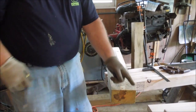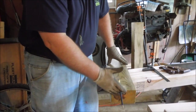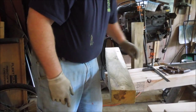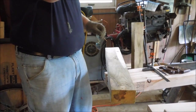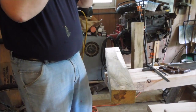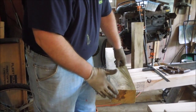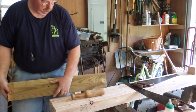If I were to try and cut it from one corner to the other, straight through, it's going to give it a tendency to wander. Even this wide saw plate, because of the set, the saw plate's a little thinner than what the kerf is, and you can tend to curve. But by walking it around, you counteract that curve by making it a small increment in each place.